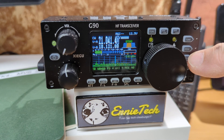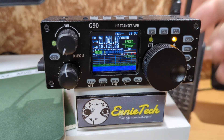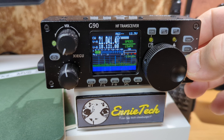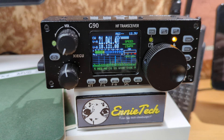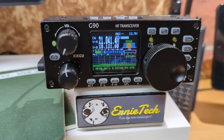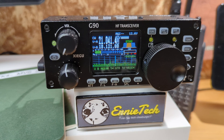You go over here to the key button and hold it down for a second. You'll notice that it goes back to the waterfall — that's the default mode. If you press key again, it'll go into decode mode. All you have to do is tune until the CW lights up this LED just about in time with the CW code. And if you're lucky and the audio is consistent and the signal is loud enough, it will begin to try to decode the CW.